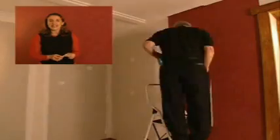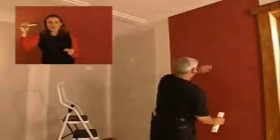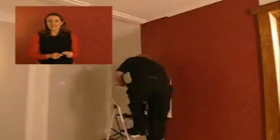Here's a handy tip. Keep your knife angle as flat as possible to the cut, and snap off the used bit of blade after making 2 cuts. That way you reduce the risk of tearing.